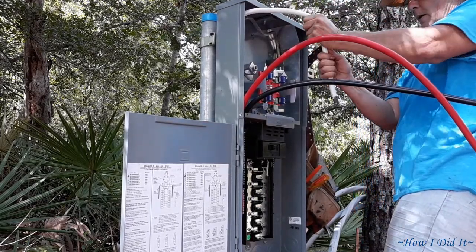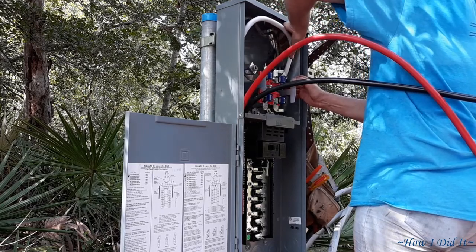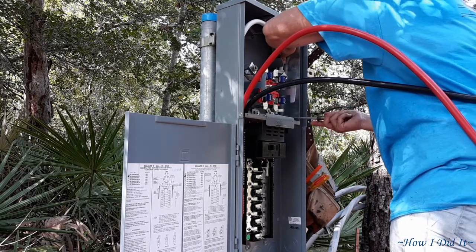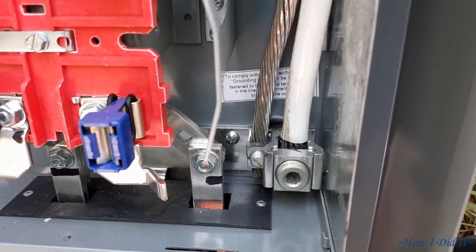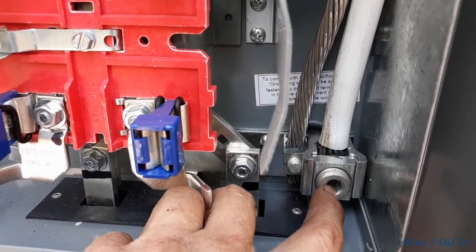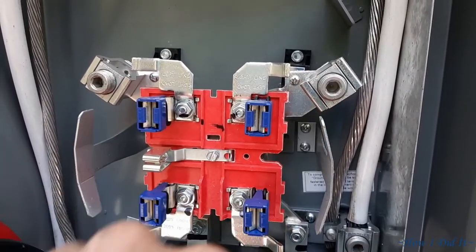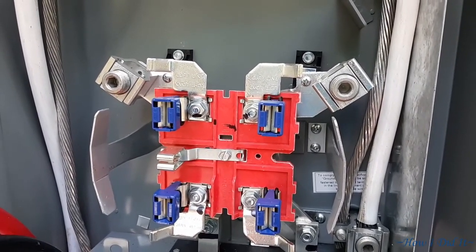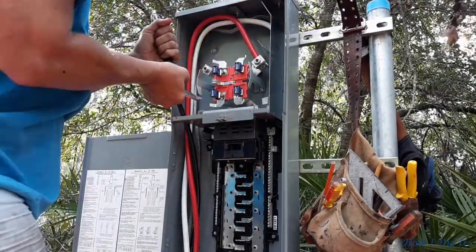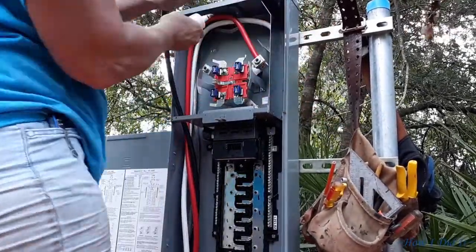Something that an old electrician taught me many years ago: save as much wire in that box as you can without it being a jumbled-up mess, just in case you need to extend it out - it gives you wiggle room. The ground wire is connected by screwdriver but the neutral uses an Allen key, so I'm going to set my two 110s first and then go get my Allen wrench. Here I'm finishing up the red and the black - your 110 positives - and that's where your meter is going to go.